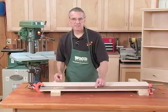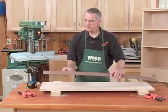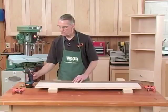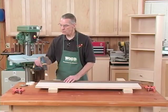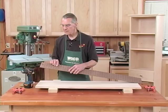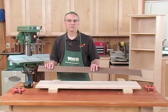When you've got the entire first line of holes drilled, unclamp your strip. To keep the spacing from the edge even, flip it over and align the top and side. If you're not confident about your ability to keep your drill perpendicular as you're drilling the holes, you can always do this on your drill press. The disadvantage of using perforated hardboard is that every time I drill, I wear out these holes a little bit — sooner or later they get so sloppy I'll have to throw this away and make myself another strip.